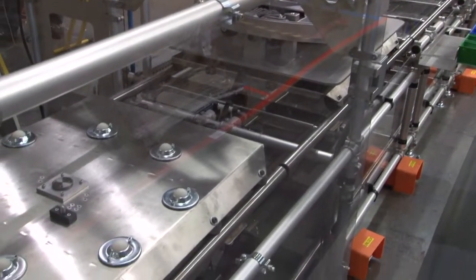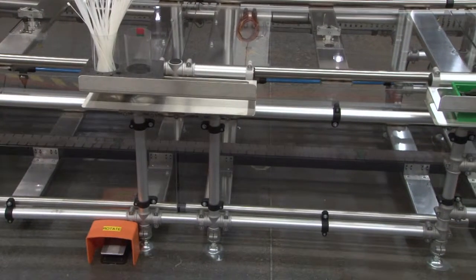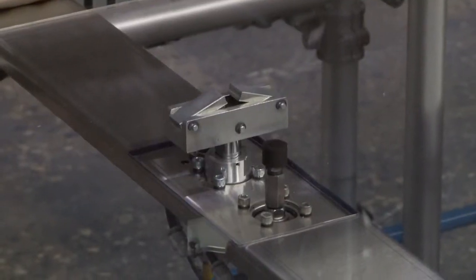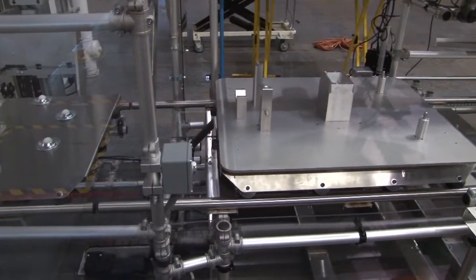The track system was fabricated with high strength stainless steel tubing welded to a support structure. The carts are locked in position at each station with a custom pneumatic lock and released by foot pedal. A cast aluminum plate with precision machined details positioned the product on the cart.